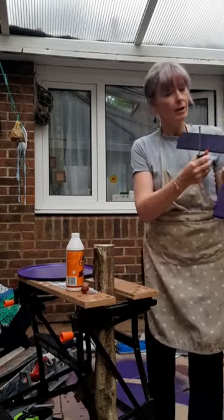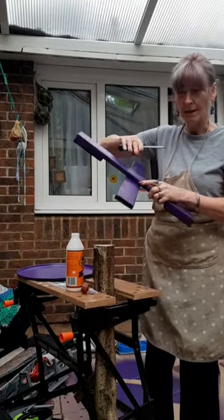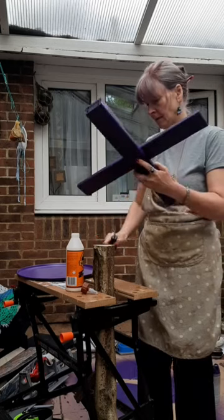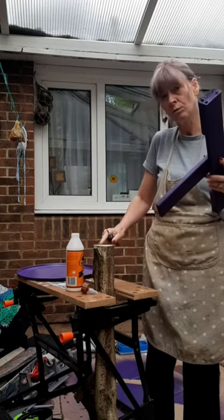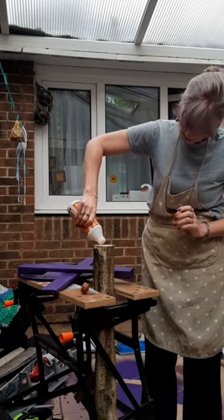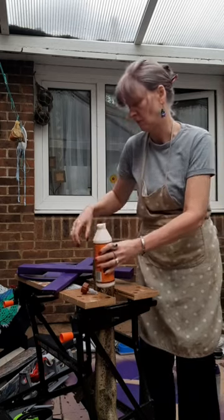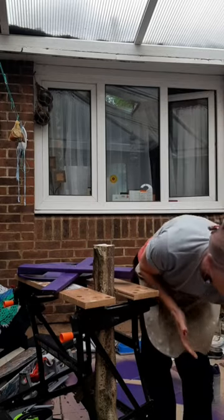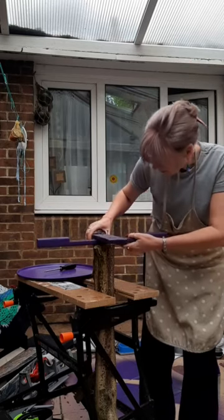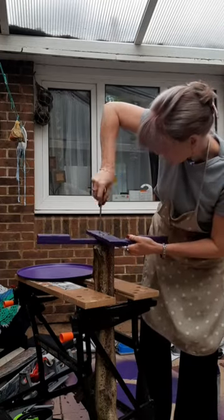Right, I've already screwed these three in, so that they're ready. I'm just going to do the centre one a little bit further, so I'll be able to place it onto these. I've actually drilled some lead holes in the top here so it can go straight through. We're using the glue and the screws because again it reinforces it. The glue on its own won't be enough, the screws on their own won't be enough, but together they work well together. So, now, that one in the middle hole. Screw that down a little bit until I get the others down. Let's find the holes.